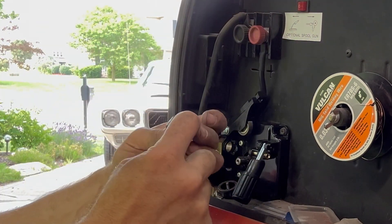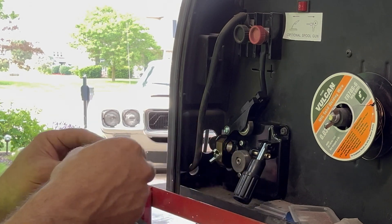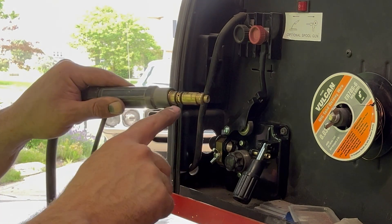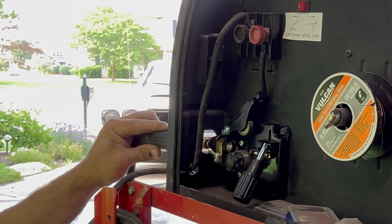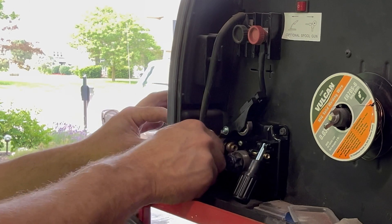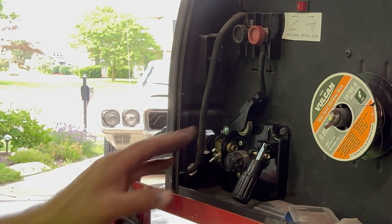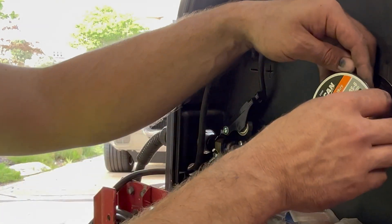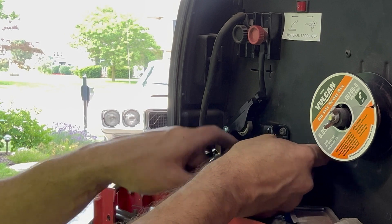Put our drive wheel back on - I've got different sizes for different wire sizes, but I'll put it back the way it was because that was working just fine. That wasn't too bad. Now I should be able to reinstall this - my O-ring's still pretty soft and pliable. You loosen this up, slide it into place - that's going to seal up nice. Now my lead is not loose anymore. That was probably what condemned my welder - I was guilty of dragging it around by this lead. About 20 years and that plastic finally said it had enough. Can't really complain - that was a five-minute fix.